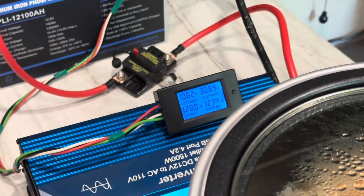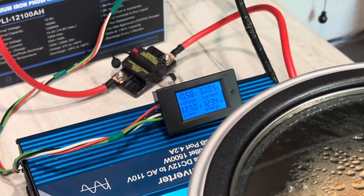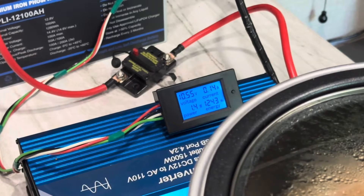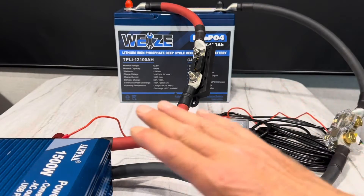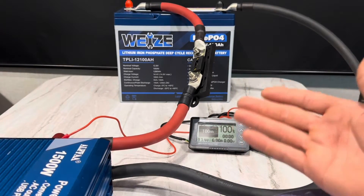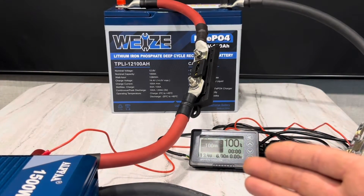My inverter alarm started going off — 1,234 watt-hours out of a possible 1,280, pulling 25 to 30 amps the whole time. I shut it down at 10.5 volts, and the inverter cut off on low voltage at 1,243 watt-hours out of the Wyze battery. That was 97 amp-hours on an inverter — a real-world test. With a dedicated capacity tester I probably could have gotten closer to 100, but when your inverter cuts off at 10.5 volts, that's all the capacity that matters to you in real-world use.